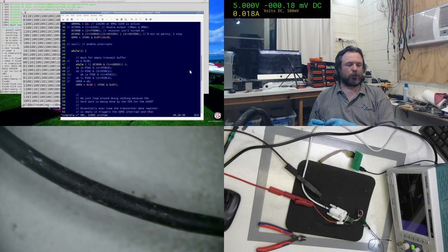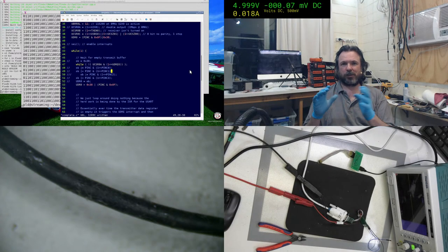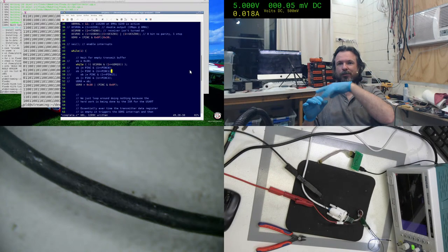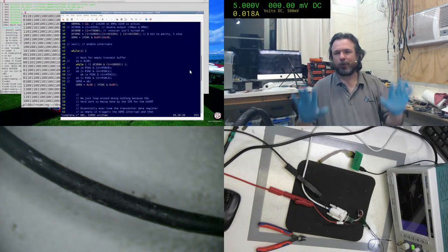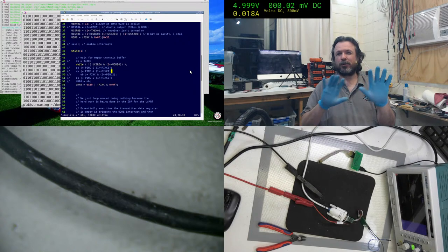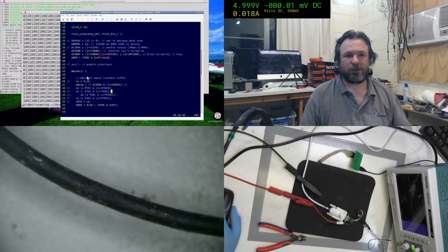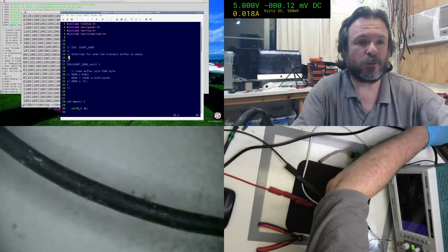If you Google low sampling rate aliasing, or even when your sampling rate starts approaching the rate of your signal, you get this weird aliasing effect where what should be a very fast waveform actually starts becoming just this very slow waveform. It's kind of like when you slide a mesh or a vertical grid or a horizontal grid over a picture, and depending on the picture you can sort of see different patterns emerge. Anyway, so that's really that then. So I think my code originally did work, it was just my understanding of what I was reading was wrong.